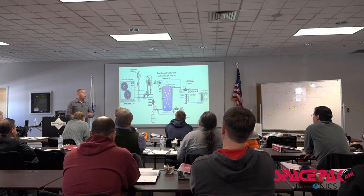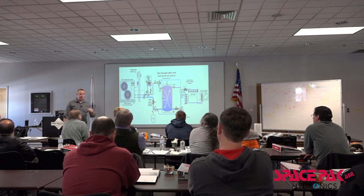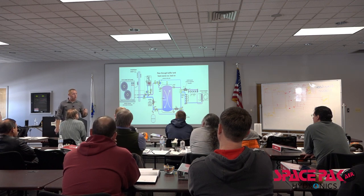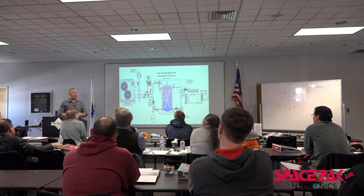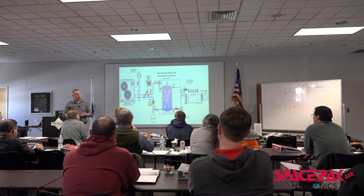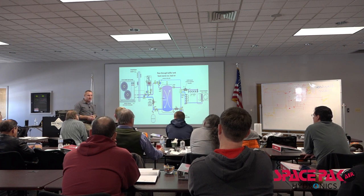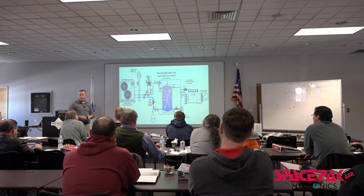So let's fire up that heat pump first, every single time. And if it doesn't reach set point, if the temperature drops enough, we'll call on the boiler and have them both run together to reach that set point again. Then it'll shut off, and when it calls again, it'll turn the heat pump on again. Because maybe that next time, the load is so small that the heat pump can handle it, even though it's -5 outside.